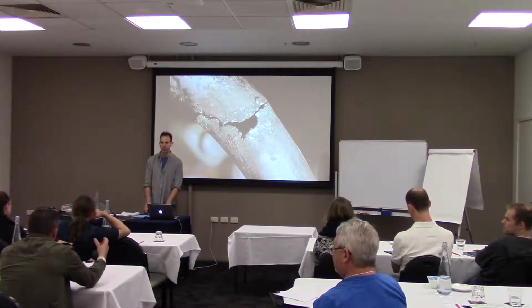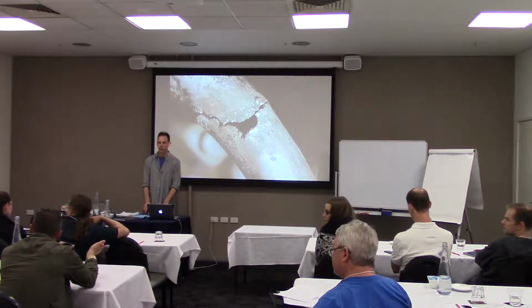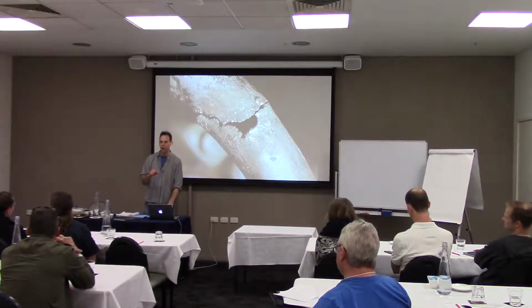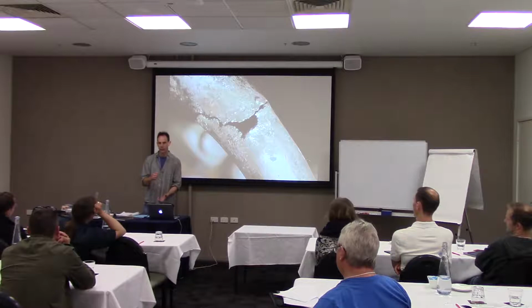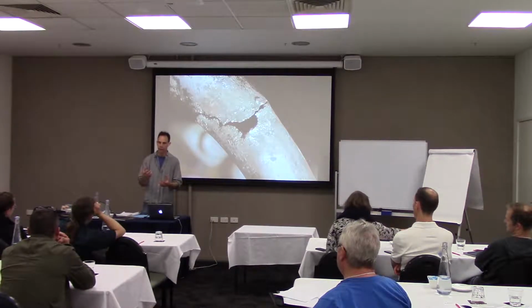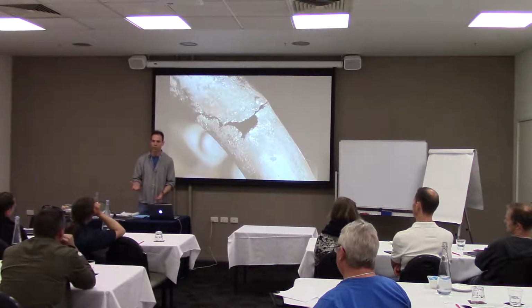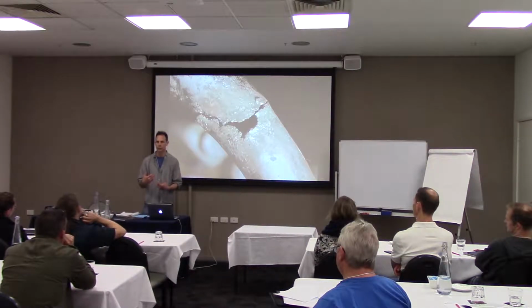When you do get a copper pinky sort of film, is that bad for the instrument as well, or not? No, actually, that's a plating that's happening. What's happening is an electrolytic reaction of steel. So if you put a saxophone or something in there that's had steel, it's now created this electrolytic reaction, so it's taking the copper that's leached out and replating it onto the instrument. That's why with a new solution you won't get that, but as time goes on, some copper leaches out into it, and then it's plated back onto the instrument, so it's coming out pink.